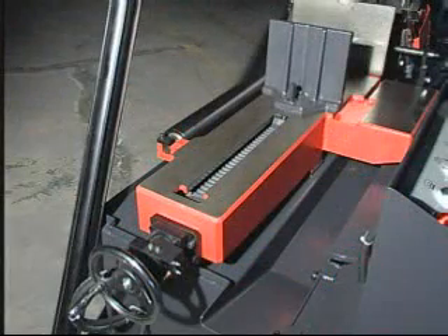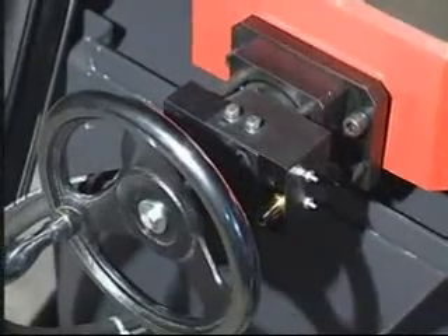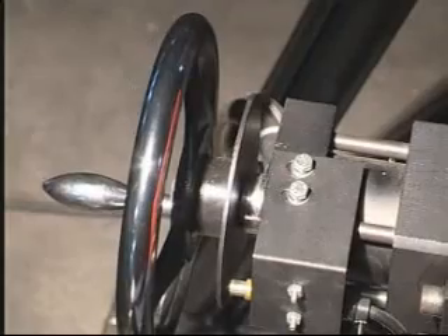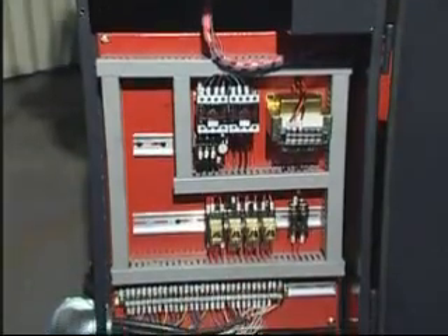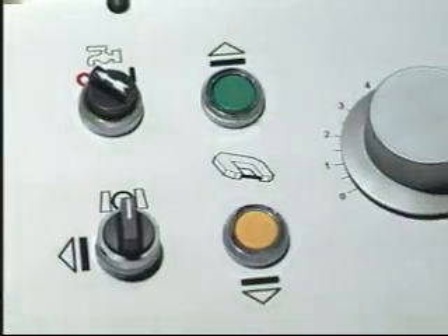The vise system uses a rack-type quick-moving vise and hydraulic cylinder to quickly clamp and secure the material. On the cylinder is a sensory limit switch. The control system consists of precision electronic parts and easily read simplified icons on the panel, making them clear to operate.